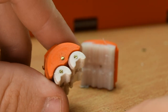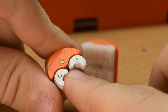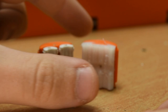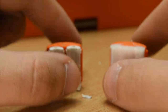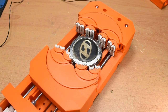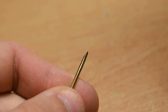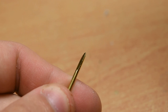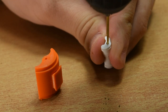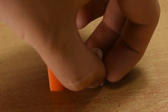We shall begin with the jaws. There are two options: the elastic and the TPU versions. The elastic option is more complex but it is more dynamic. The TPU option is much simpler, but a little less dynamic. I will show how to make the elastic one now. First I will take a roughly 40mm length of the wire I am using and, using a file, fashion it into a makeshift drill bit like this. I will then use this to make sure all the holes are the ideal dimension.